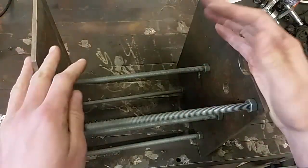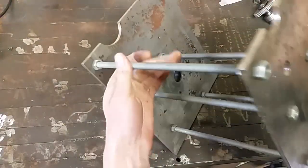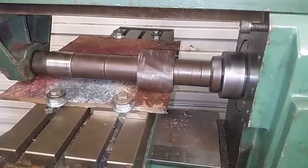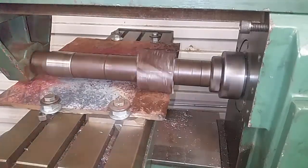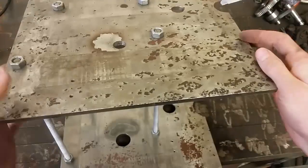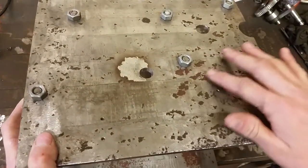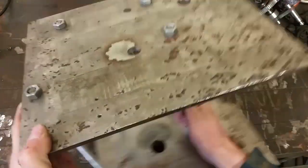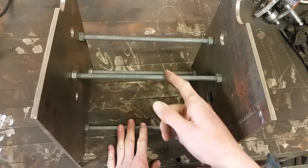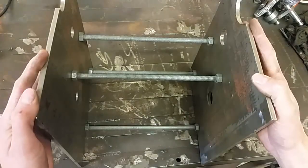A lot of this build has been rushed over and nothing's really been explained to date. In the first episode I made the side plates. This was horizontally milled out of a really scrappy piece of plate. I plan on cleaning out all the rust pitting that's still in here and filling it before I paint it for final assembly. I'm not going to rely fully on threaded rods to hold it together — threads are really bad in bending, so I aim to weld in some members and make this a bit more solid.